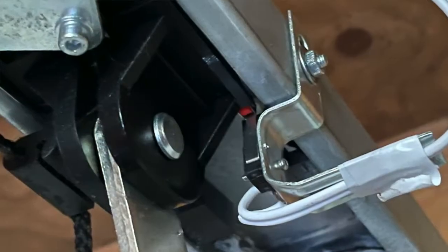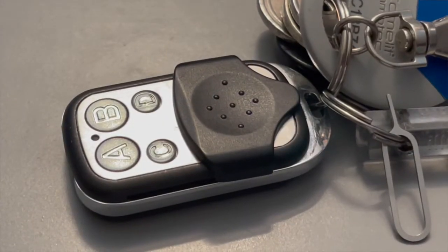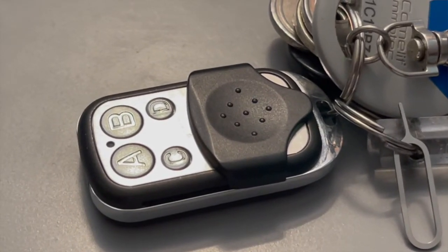To make the device smarter, in addition to the relay I will add two sensors. They are just simple micro switches and what they will do is sense if the door is fully open or fully closed. This allows us not only to control the door but also detect if the door is opened or closed — even if I use one of the remote controls. The sensor will detect the change in state and will update in the HomeKit app accordingly.